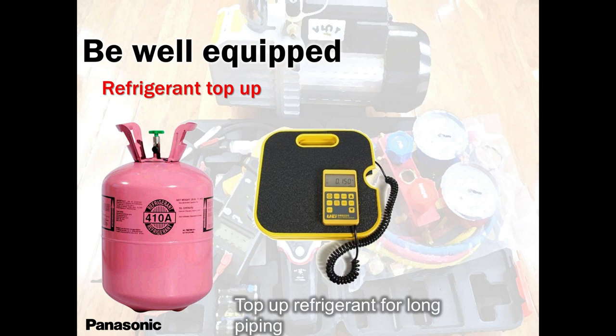Always weigh in, weigh out. Never use the same refrigerant that you pulled out. Please, never use it. I don't trust that refrigerant. Put in new gas, the gas that you trust, that you know is brand new. So please remember to weigh in and weigh out. That way there is no guessing business. Topping up is not a good idea. If you want to do it for testing purposes, go ahead. But eventually you need to recover and recharge brand new gas and weigh it in, please.